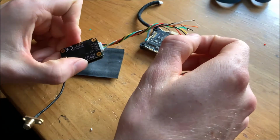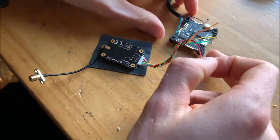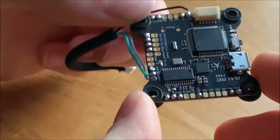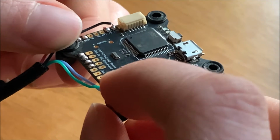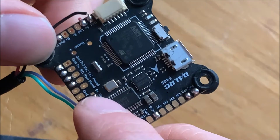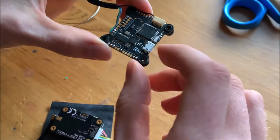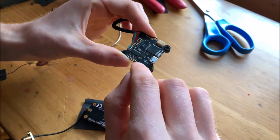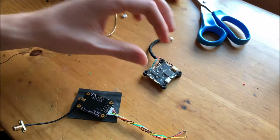It looks like our input voltage is from 7 to 26 volts on this. So if we look at our pads, it looks like we have our 9 volt pad connected, which means that any of our VCC will supply the 9 volt. So that's where we'll connect that to power.